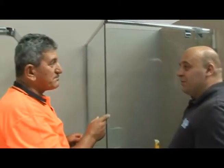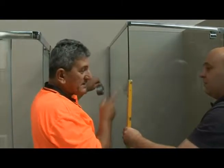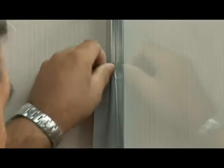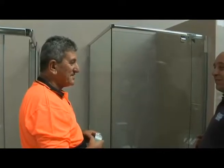Now that the front door is plumb, we now plumb up the return panel here and we keep it in place with duct tape as we did along the front panel. So I'll hold it along here, hold our level there — well, that's spot on. Now what we can do, we can apply our duct tape along the side panel here to keep it all in position. So everything's plumb and taped and fixed. All we do now, we attach our screws and fix it in the locking position, down our channels and along the top.